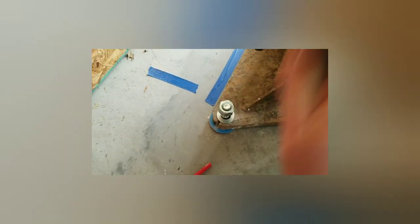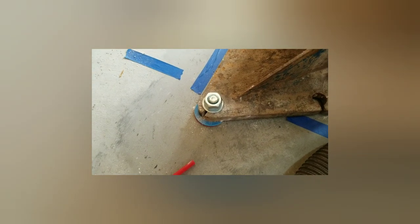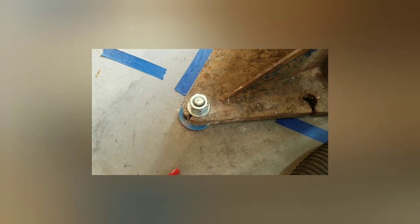I got that cleaned out and went ahead and installed my washer and nut. You need to make sure you've got at least six threads below the line of whatever you're anchoring, because you may need that much room to get this torqued to spec. Set it in and then just hammer it down all the way. I have not hit the bottom of that hole — if you hit the bottom you've measured wrong and need to drill a deeper hole. Now I get it finger tight and after I get all these in, I'll torque them all to spec. That's how a concrete anchor works.